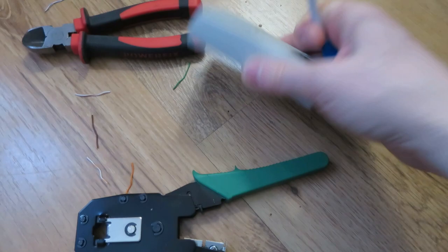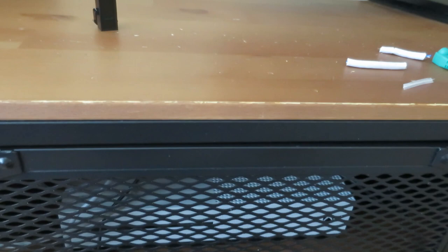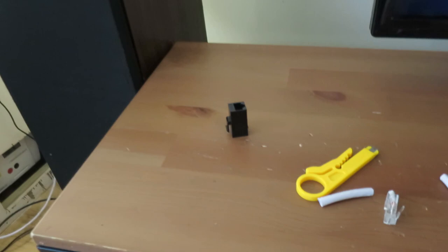What I'll do first, I'll rewire this jack again, just in case, because that's only going to take me about 2 or 3 minutes. Whereas pulling this out, getting the Hoover out to get rid of all that dust, because you can't really work back there with all that, and pulling that socket faceplate off and tracing the issue there and re-punching down the faceplate is going to take much longer. So let's redo this connector. So that's the jack rewired once again, equally as successfully.